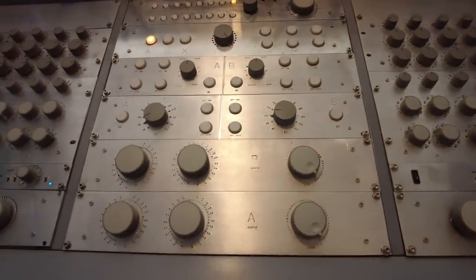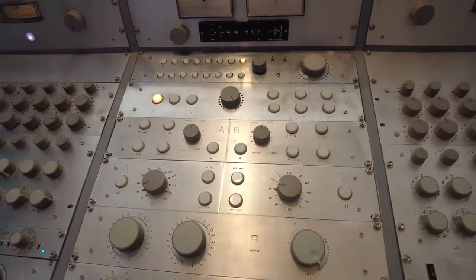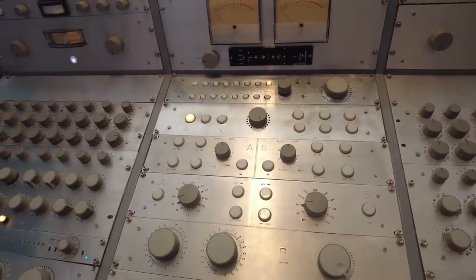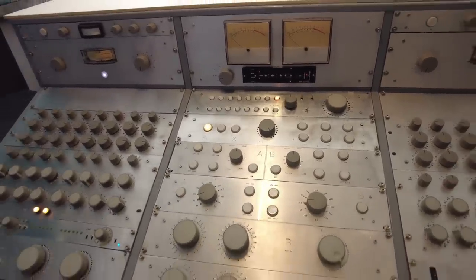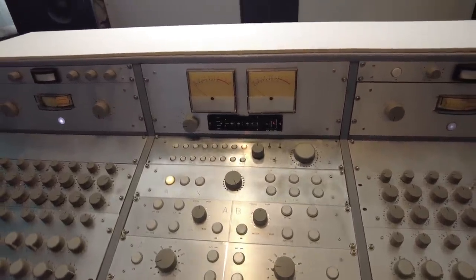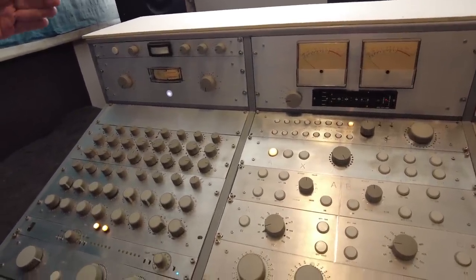What's the benefit of that? The purpose of the A/B path console is for mastering directly from open reel tape to the lacquer master record without going into the computer. The reason you need to do that is that a record is cut all at once - it's cut as a single spiral from the outside diameter right to the inside diameter. You can't edit as you do it.